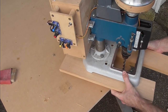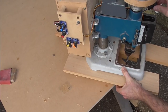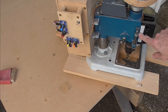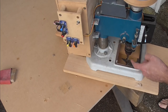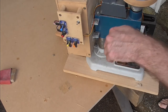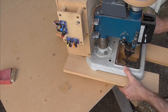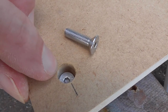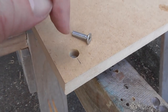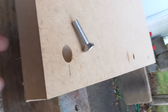I'm using a drill press to drill and countersink these holes — it's a bit easier than a hand drill, keeps them straighter, and lets me control exactly how deep the countersink goes. Another advantage is that when drilling large holes in MDF, the drill tends to grab and shove itself deeper because the MDF is quite soft — the drill press gives me a lot more strength to stop that. The result gives about 9 millimeters of clearance at the top, 10 millimeters of contact with the aluminium at the bottom — that should be okay.